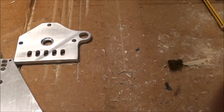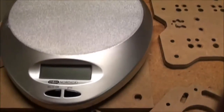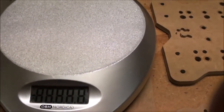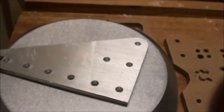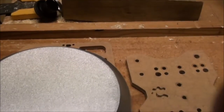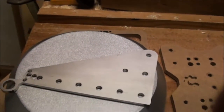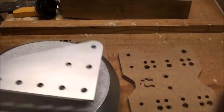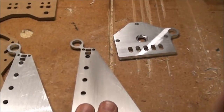It's 4mm stainless steel, so it looks very nice. If we look at the scale here and take these two identical parts — this part is 102 grams in 6mm aluminum, and this one is 201 grams for the same part in stainless. They are somewhat heavier, but I think 3mm stainless would be sufficient, and these are extremely stiff. I think I'm going to get pretty good results using these.